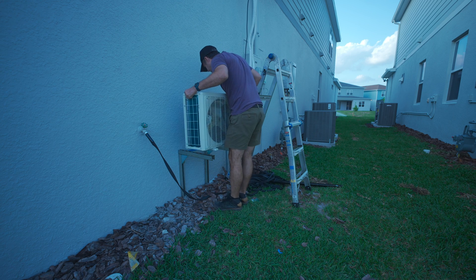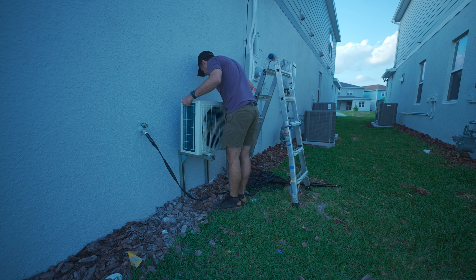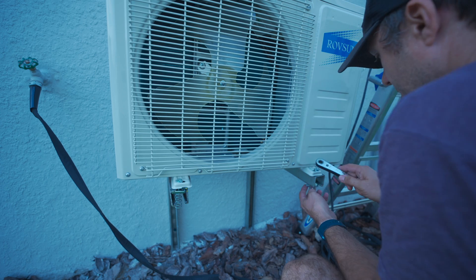The heat exchanger that sits outside has little feet on it — they're 16 and a quarter inches apart if you get the same one. If you put it on the ground it has to be on a concrete pad, so I wanted to attach it to my wall. They do sell pre-made brackets from Amazon for this — I'll link one below — but I really wanted to make my own. I bought some hardware for Unistrut channel I had laying around, chopped that into nice little industrial L brackets, and bolted them to the wall outside. With those in place, I heaved the unit onto my new brackets, bolted it down, and then went back inside to work on the electrical part of the indoor unit.